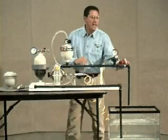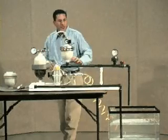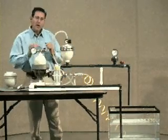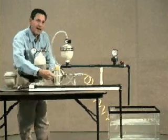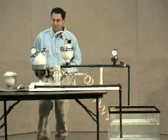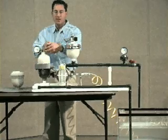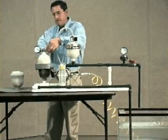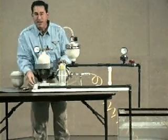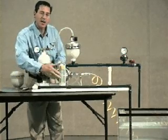To demonstrate this, I'm going to put a little extra head on the discharge, since we have a very short suction lift. The greater the differential pressure between the discharge and the inlet of the pump, the more rapid and positive the seating of these ball valves will be, creating a more violent pressure spike. To demonstrate the inlet stabilizer, I'm going to overcharge it, removing it from the system. Now as I turn the pump on, you will be able to see the pressure wave going back down the piping system, and the pipe will be shaking. That's the pressure shock created when the ball valves close.